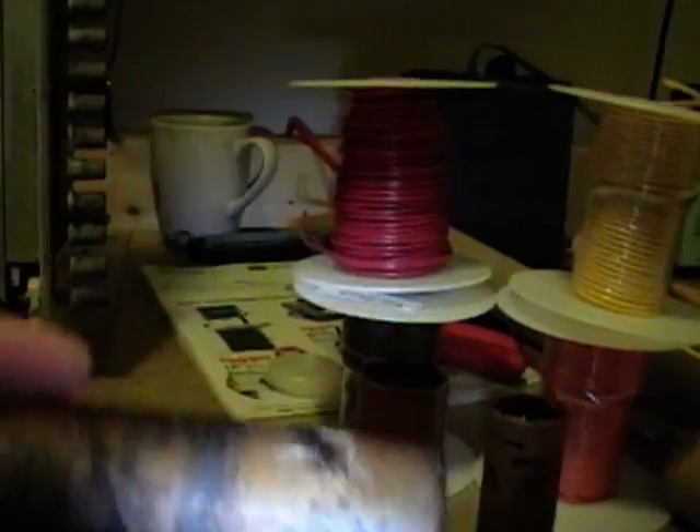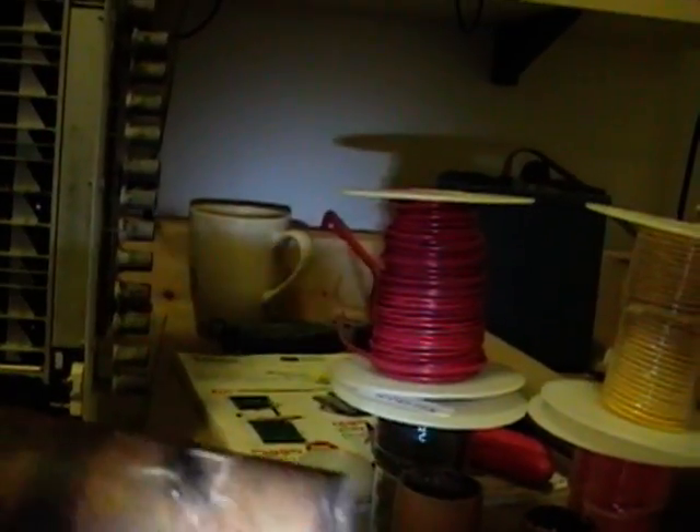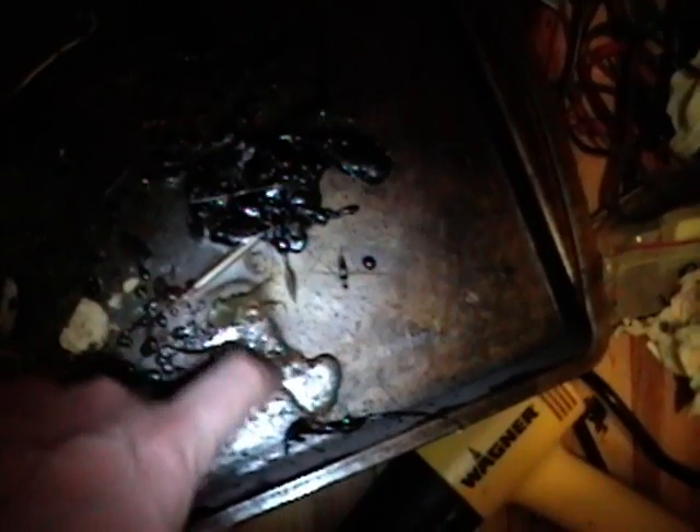This last one I still haven't decided on — it's also got pretty burned up, melted, and kind of nasty looking. So once I get the new capacitors in there and hook up the wires, what I'll do is use some of this old wax to plug the end back up. This old wax is really nice stuff because when it hardens it's much harder than modern beeswax or candle wax, and it melts at a pretty high temperature too. Otherwise, hot glue or caulk, just to plug up the end and keep things held in place.